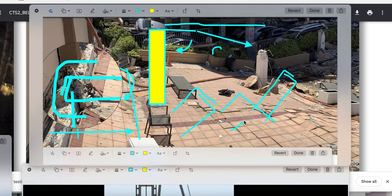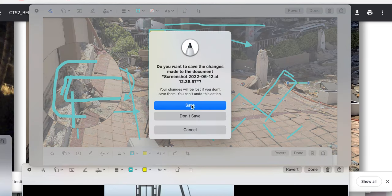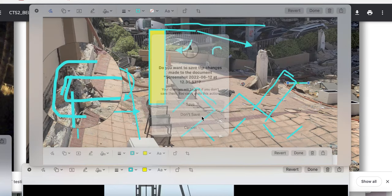When I look at the wall system over here, I see these slots — they're kind of like that, like separation like that, and I'm guessing the separation might be 12 inches at the base here. So the spacing from this cone to over there — that spacing is probably like that. Remember the rebar interacts — some of it popped off, it pulled out, and some of it stayed behind and just fractured right here. You would be able to take apart the concrete and find an embedded piece at an angle to prove or disprove my statements.